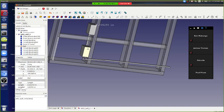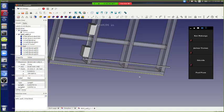At the stage where each of the panels has all the electrical inside, then it's just running the wires from the electrical breaker panel. Which means the electrician, if we hire an electrician, or you can do it yourself, would just run the wires from the breaker box out beyond the utility channel, and then close the utility channel by screwing it into the blocking at the top or bottom. It doesn't get screwed in between the panels or anything like that.